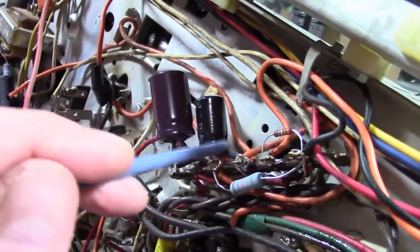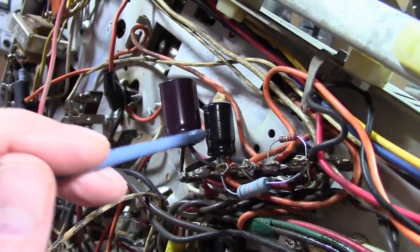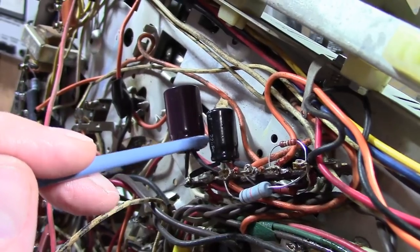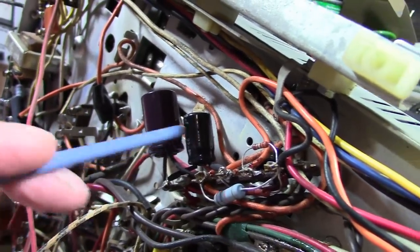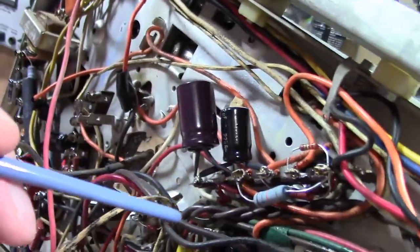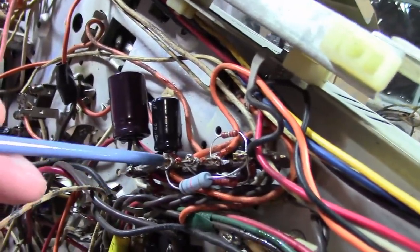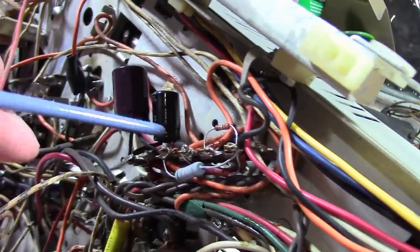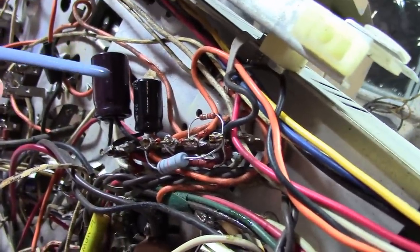That was a 350-volt cap, but DC — not meant to have AC across it. So what is possibly going on here? Well, of course, I could have made a wiring error. But remember, we have B-plus disabled, so where the heck could voltage be coming from?